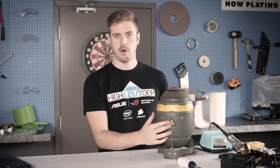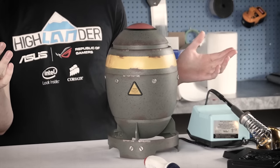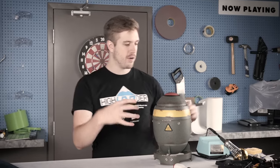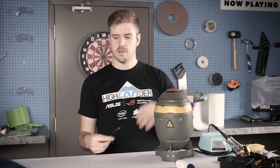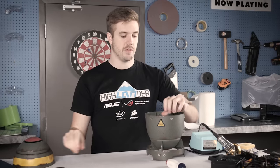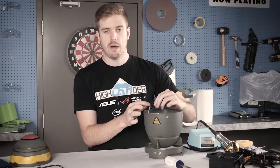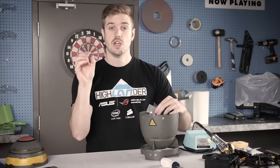When you press this button right now — awesome, super quality, that's great. But I want this button to also turn on the computer. I could have hooked it in in parallel onto the power switch using this and stuff, but there's some voltage problems. I'm not super great with electronics, so I'm gonna solder in another switch. How this thing works is it's a big plate that presses down onto another plate which has a button mounted in it, so what I'm gonna try to do is add another button so that this plate pressing down actually presses two buttons.